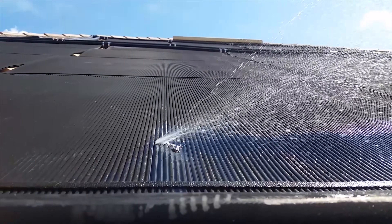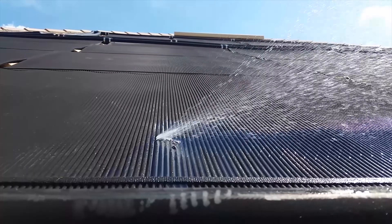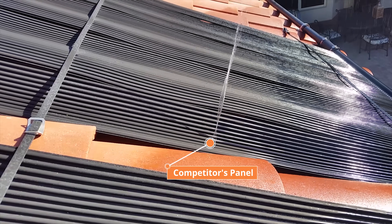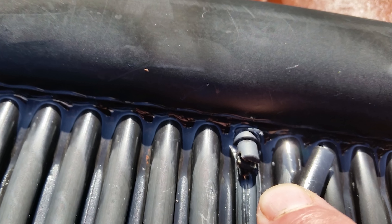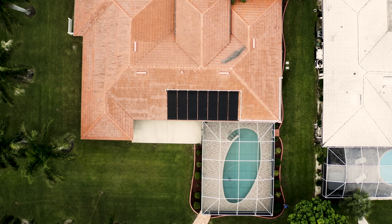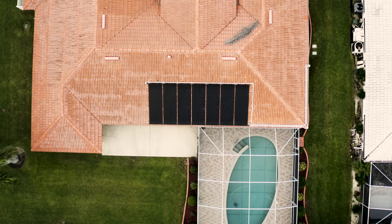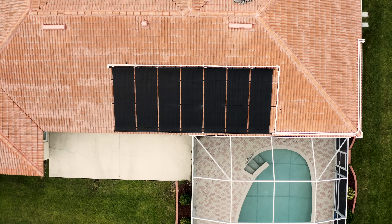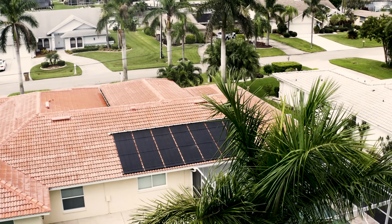Leaks are rare during your solar panel's 12-year manufacturer's warranty, but they can happen. Solar panels are rugged, but also exist in a very challenging environment. Leaks can be caused by physical damage, rodents, manufacturing defects, or other reasons. The good news is that most leaks are easy to repair by a qualified technician and only impact one tiny tube out of hundreds. You may have a leak if you notice water coming out of your gutter downspout. First, double check that water is not coming from condensation, which naturally occurs especially when we have cool nights. If dripping water stops later in the day, you're probably just experiencing condensation and no action is required.